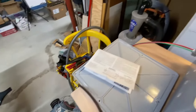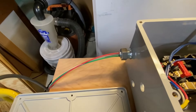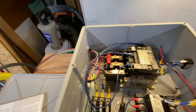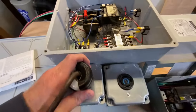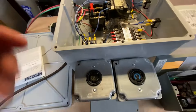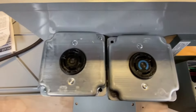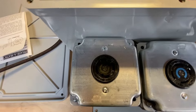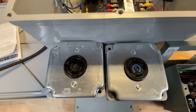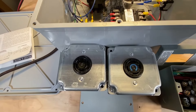The other switch pulls the contactor in. Notice smaller blue wires, signifying lower current. Three phases out of the Phasematic — the generated phase runs through this switch so I can pull it out of the circuit once the idler motor is up. Then all three phases end up at the input to this big contactor. This other switch pulls the contactor in and carries those three phases to its output terminals. The output terminals carry that power in two directions: one down to the idler motor, and the other pair comes through these fuses and out to these two outlets.